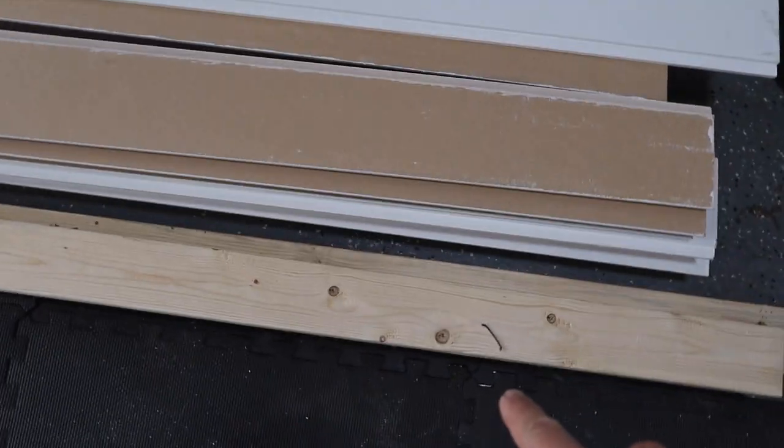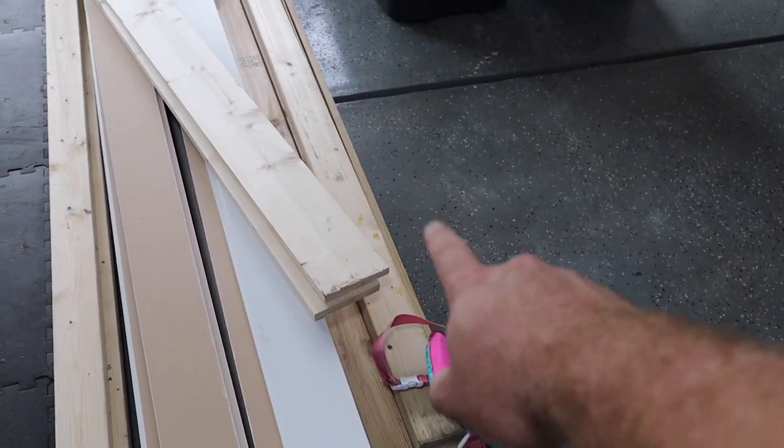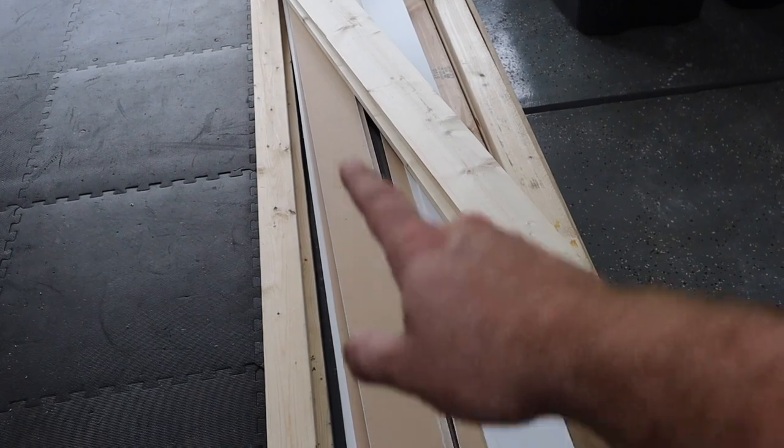I made it out to the garage and I realized I didn't show you guys all the stuff that I bought. So I bought two 10-foot two-by-fours, five two-by-four-by-eights, some one-by-fours just to see if I go a different direction, and then 26 pieces of shiplap. I did get the MDF shiplap this time — did not get the wood because it was expensive. What I'm gonna do now is start framing out that fireplace. I'm going to start with framing out my sides and cut all my pieces at 108 and 7/8 inches so I have a little bit of gap top to bottom to adjust as needed.